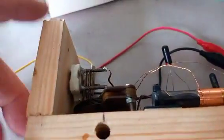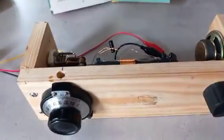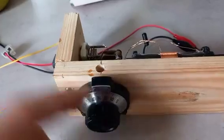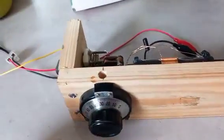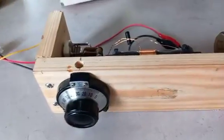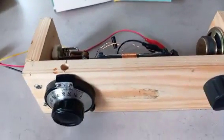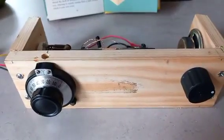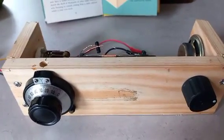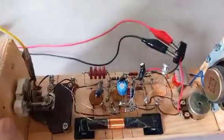One other departure is this control here, which is called the regeneration or reaction control. When you tune this to a station, you have to adjust this little trimmer capacitor — it's called a compression trimmer, about that big — and you'd have to adjust it, tune, and adjust again. Back in the day that was a real pain, so this control gives you instant access to it. Medium wave just doesn't have the radio stations it used to have unfortunately, but it will pick up a few.